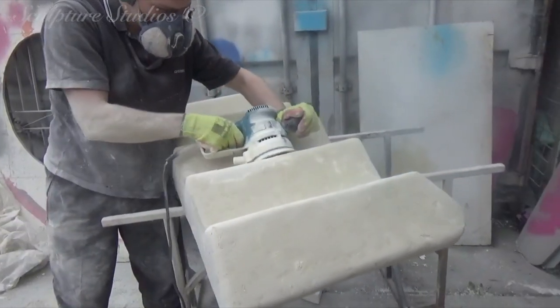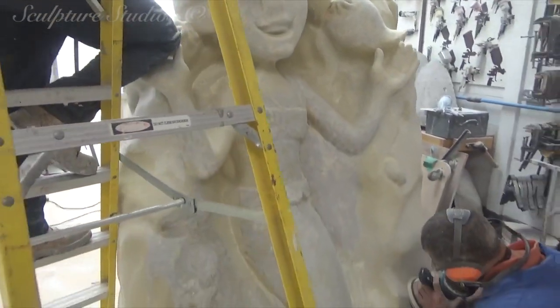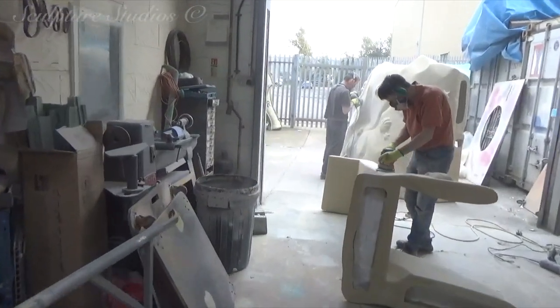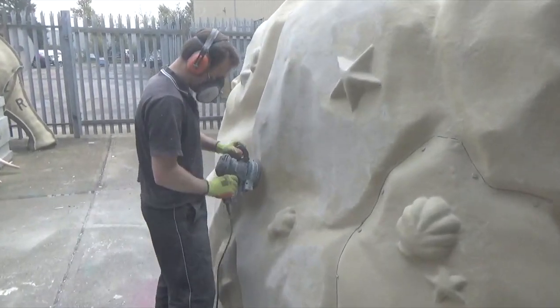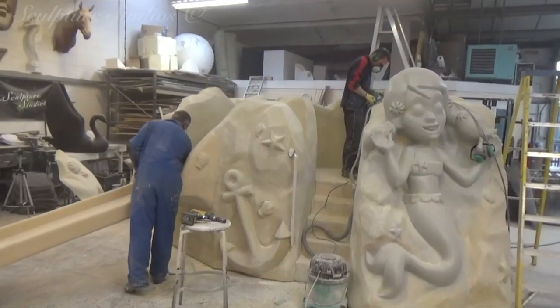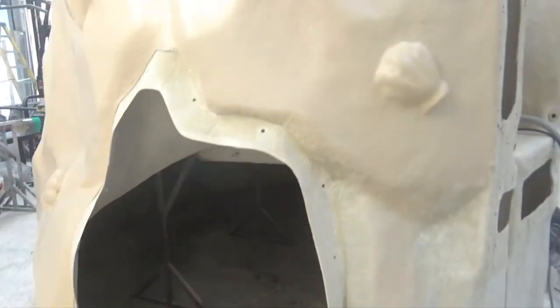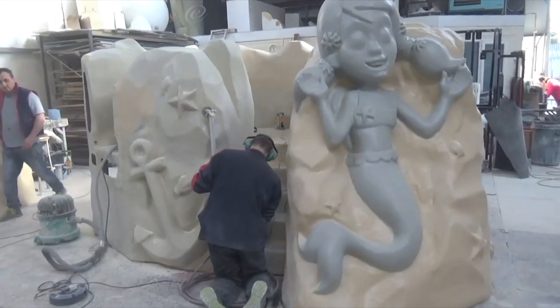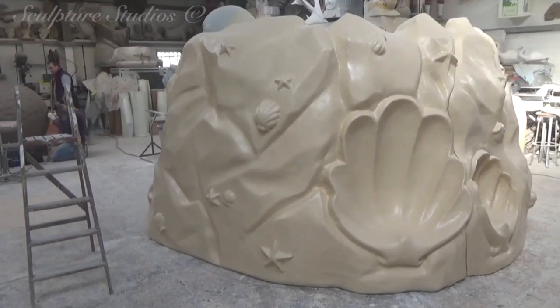Always great fun having to spend days going over the entire surface and cleaning it all up. The fibreglass has had a flow coat layer of resin applied over the whole sculpture, and we're now using sanders, sandpapers and elbow grease to get this to a decent finish. Going over with a flow coat helps to lose that fibrous texture of the mat underneath. We can't leave any sharp points, as even if this wasn't just for kids, we don't want anyone getting injured. We also want this nice and smooth for the artwork. We could go over with an actual sand texture finish, but we're trying to eliminate as much opportunity for injury as possible — smoother rather than textured is the better option, with the texture made up in the paintwork. This glossier finish also means there's less opportunity for dirt to get trapped and it will be a lot easier to wipe down and clean.